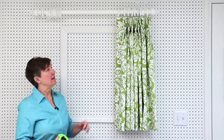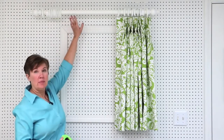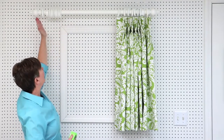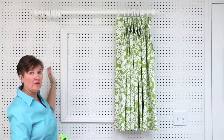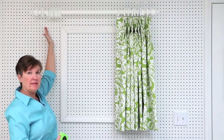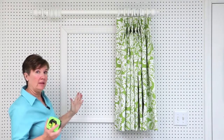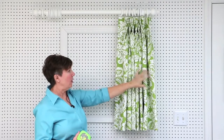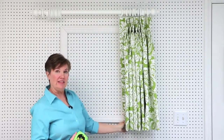After you've measured your windows you'll need to decide what type of drapery hardware you want to hang your panels from — there are a couple of different options. In our example I'm going to use a pole with rings to hang the drapery panels. If you notice, I've mounted the pole wider than the window and I like to do that because it makes the window look bigger and most of the panel will actually stack on the wall area instead of into the glass.